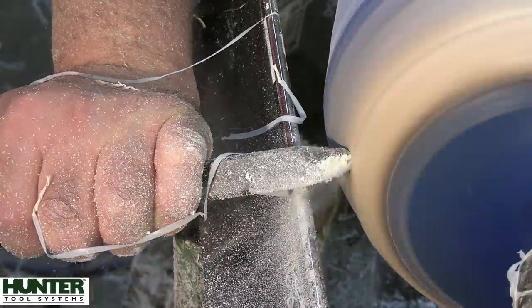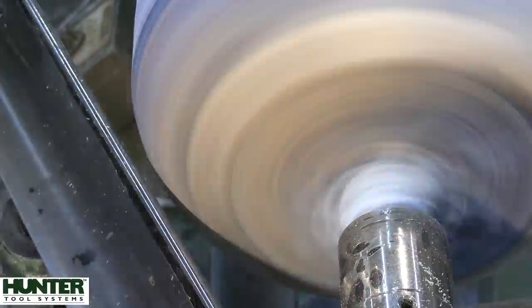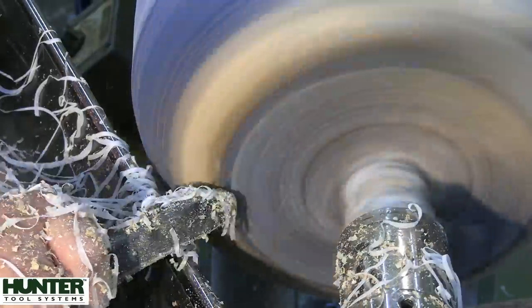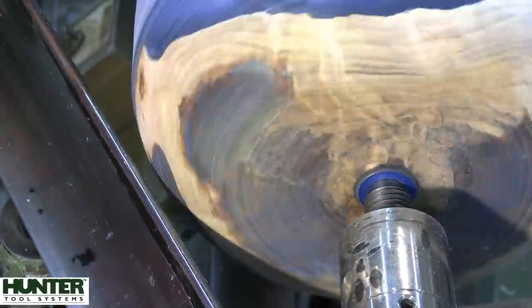Another real-time clip as I promised — I try to keep a few of those in there just to give you an idea of speed along with the tool. Typically most of these castings I turn between 750 and 1000 RPM — that's the normal range that I turn these castings in.